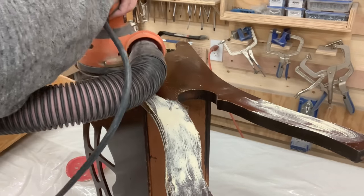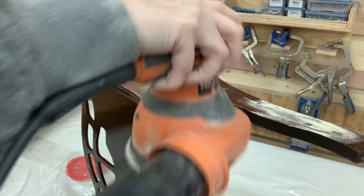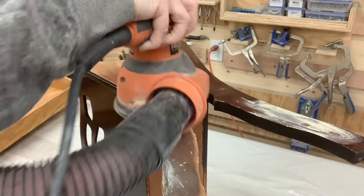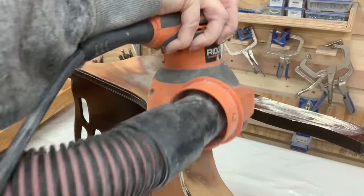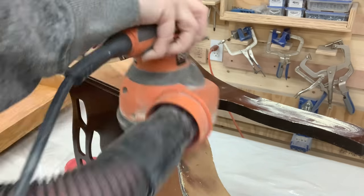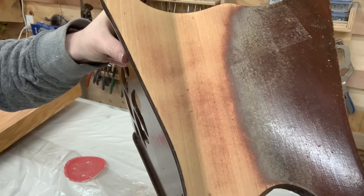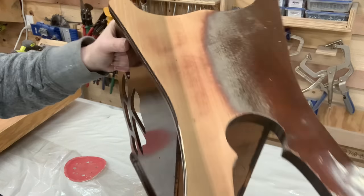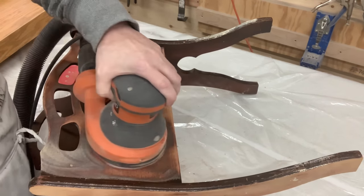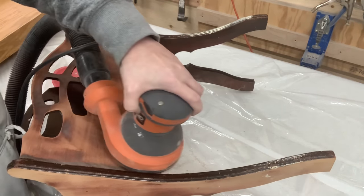Some types of paint do actually bleed all the way through, especially since I know that I'm going to be painting this piece white — I want to get all that stencil off. As I started to sand this piece to even out where I had put the water putty at the bottom of these legs, I noticed that the sander was going right down into the wood. What I thought was a veneer was actually just a really heavy stain going all the way down to that poplar wood, so I'm removing it all so the texture is evened out. The front did not sand as easily, so I'm at least just scuffing it up as much as I can.